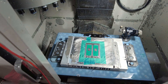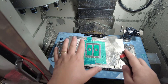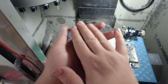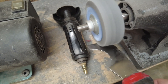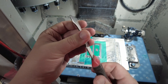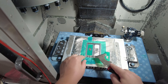And here we have our finished parts — they seem to have come out okay. No features missing, finishes look fine. Now we need to get them off the plate. I use a painter's multi-tool that I take to the Scotchbrite wheel first to make sure there's nothing sharp on it, then polish it smooth so there's nothing that will scratch our part. With the two layers of tape underneath, I can use this tool to pry the parts right up, ideally getting underneath the tape.